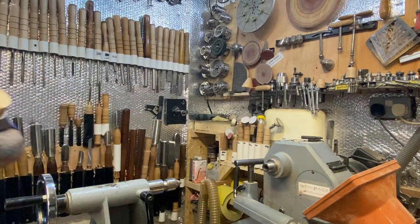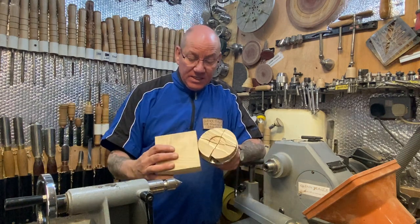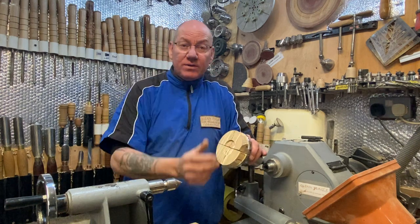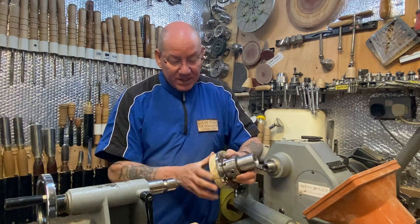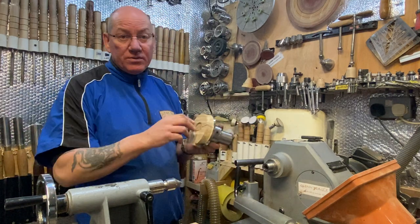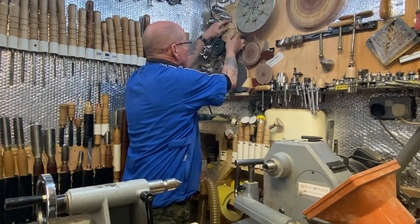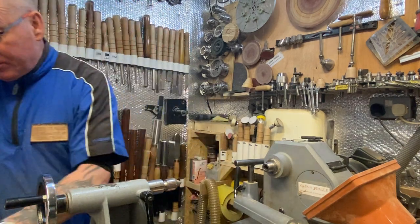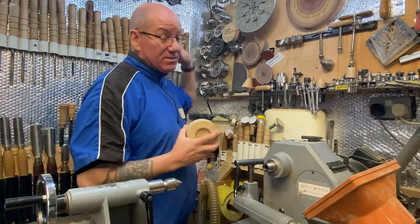When I first start, I'll go for a nice thick piece of wood because you're only turning pendants — not worried about weight. When that one's gone a little bit, you can just face it off and put fresh on it and carry on. Then you just unscrew it and throw it away — the little screws in the back are not holding any big weight. You can also use these for your boxes and pots when you want to do little lids. If you've just got half a dozen pendants to turn, I don't normally have those wooden jaws on — they come off again later.